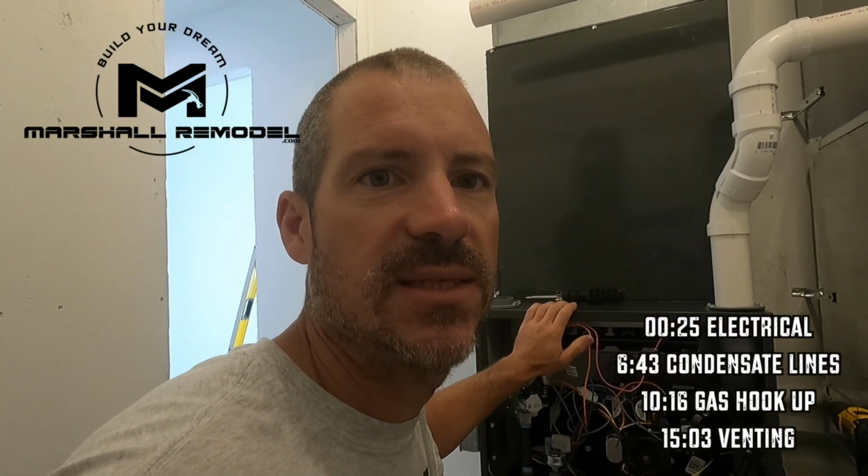I left the 2 back feet on, took the 2 front out, slid it in as far as I could, then removed the back 2 and slid the pan all the way to the back. So just keep in mind, anytime you install a unit over a finished floor, you should have an auxiliary drain pan.